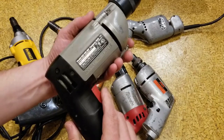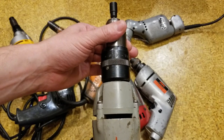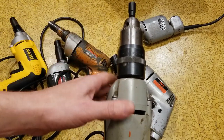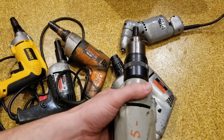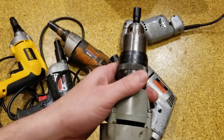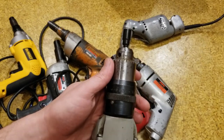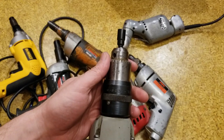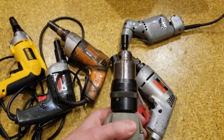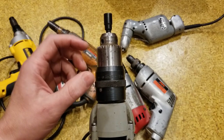The last one is this Porter Cable, which is 4 amps and 1000 RPM, so it's a bit higher torque. It kind of drags the chuck. This sleeve adjusts the clutch, but it only rotates about 180 degrees. It has a very fine set adjustment range, but it has a pretty good amount of stiction so it doesn't really self-adjust. It's kind of a weird idea where you can adjust it to operate in a clutch zone to stop turning at a specific amount of force. But it has a drill chuck on it so you can use it with drill bits — if drill bits are breaking, you can use something like this where it will slip before the drill bit breaks. Or you can turn it all the way to drill mode, lock the clutch together, and it's just a normal 1000 RPM, 3/8-inch drill.